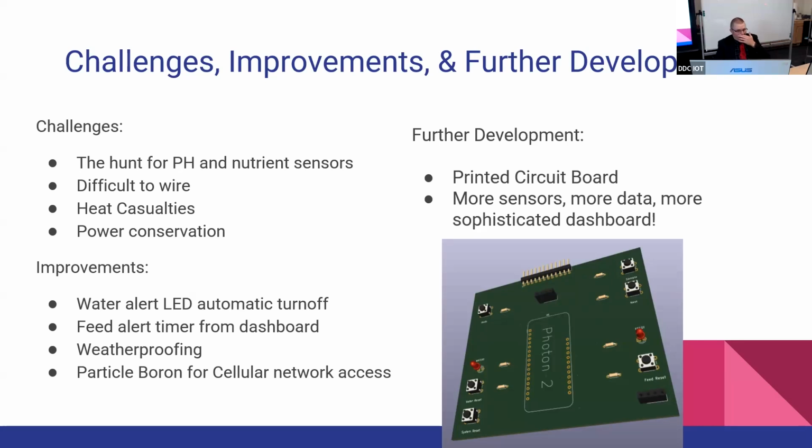So when I redesign it, and I'll get to that in a moment, I'll use a different material, maybe high density polyethylene or something. And then I was concerned about power because it's just got a little battery in there. So it does spend right now about 2/3 of its time in low power sleep mode. It just wakes up, takes some data, sends it out, and goes back to sleep. And it survives all night, so that's good. And it survived all day yesterday in the rain.